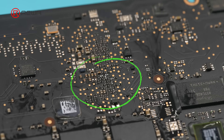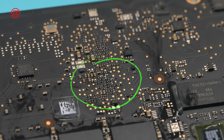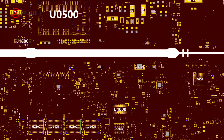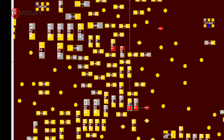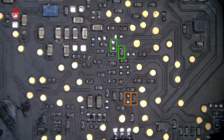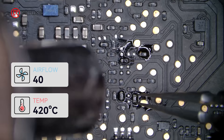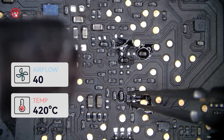Next, we need to adjust the RAM configuration resistor on the motherboard. Different RAM capacities and brands require different resistor values. From the bitmap, locate these 4 resistors. Move R2053 to the R1611 position, and R2050 to the R1631 position. This allows the board to recognize 16GB RAM chips.